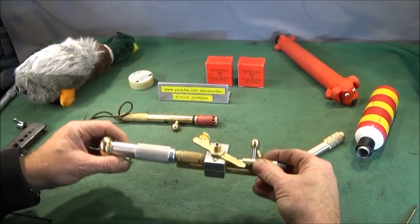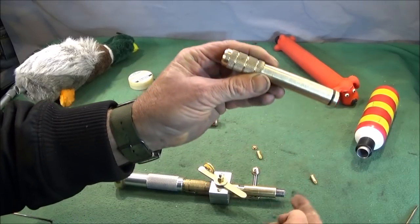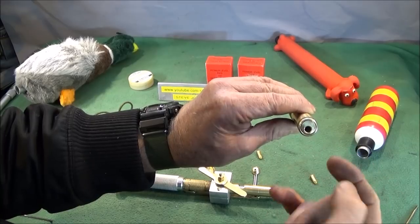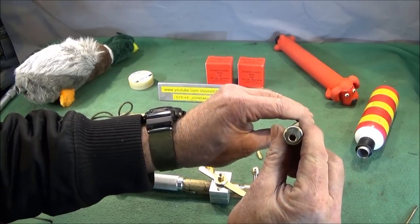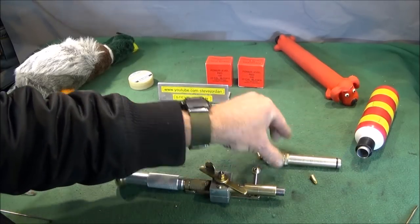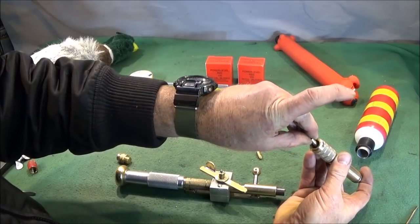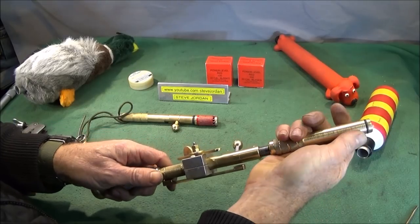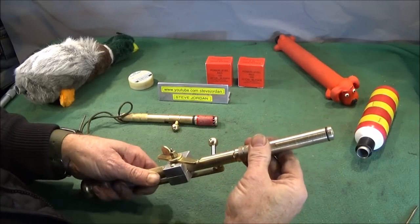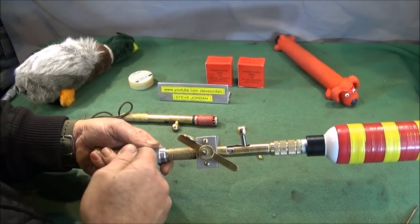firing end and reload. Now the breech end, as you can see, is central this end. The actual firing pin is offset, but this end is offset. And I machined that out, made the offset plug, and screwed that one in with Loctite 638, so there's no way that can come out, and there's no way that a hard object can be fired through that barrel. So then, whatever .22 round you choose, you stick into the breech there and screw that one on the end. And then the dummy slides down over this O-ring and is ready to cock and fire.